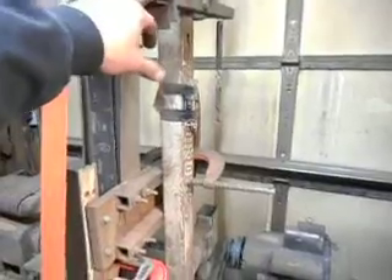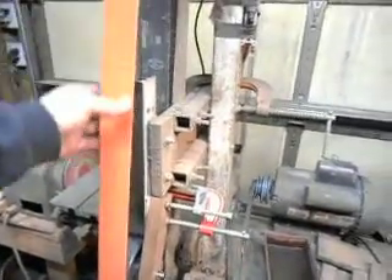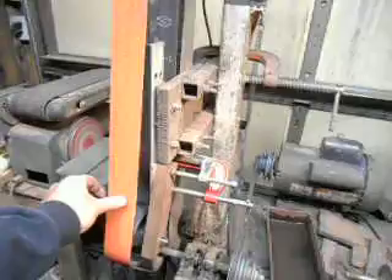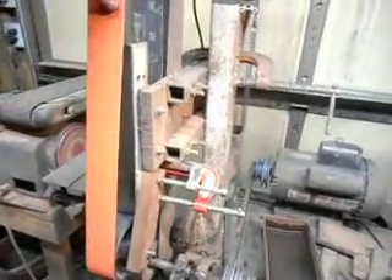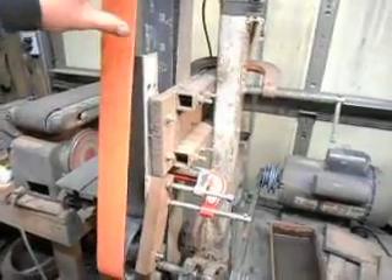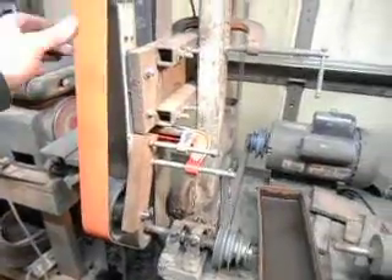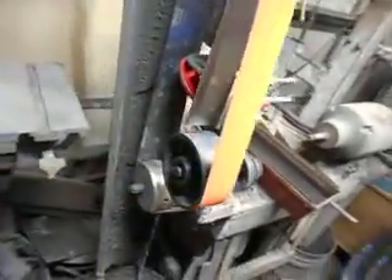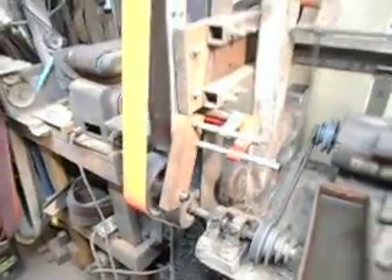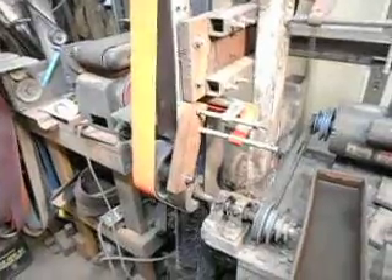Anytime I wanted a really long slack belt, if I was doing more work on the grinder for handles — usually this right here is enough slack belt for me — but if I was doing something that I felt I needed more slack belt, it'd probably be easier to set this up to pull that belt away versus pull the platen off. Anyway, I'm pretty excited about it, and I thought it was a nice cheap and easy way to convert your upright home-built belt grinder to do hollow grinds. You guys might be interested in it — see you next time.